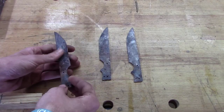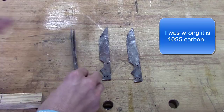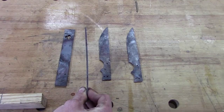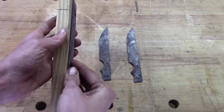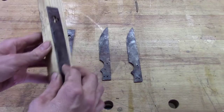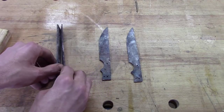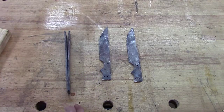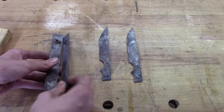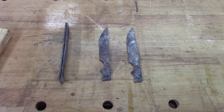The material — I'm not sure what it is. This is some form of stainless if I'm not mistaken; I'll look it up and post it and let you know. We've also got two other things to do. These here are a set of parallels and they did the exact same thing — you can see they've got a pretty good warp in them. If I hold a flat side you can see all that daylight through there. These are different types of tools — this is A2, very very hard. A2 has about one percent carbon, so pretty hard stuff. I did the same annealing to them because these were ground and had a really good finish. But anyways, we're going to give it the old college try and see if we can't straighten them.